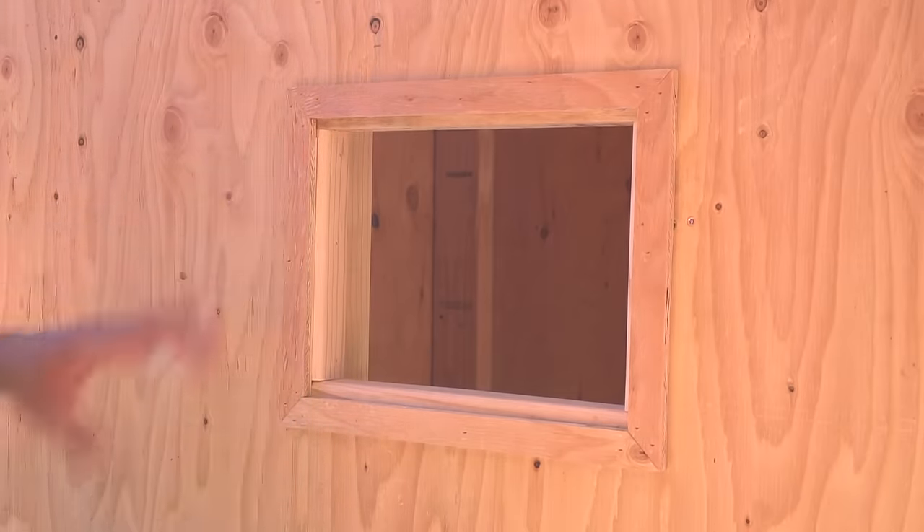We add some plywood to the base of our frame, and now it's time to make this nesting box more of a box. I'm taking scrap plywood and running it through the table saw, then making sure we have the appropriate angle so we also have an angled roofline, which makes it a lot easier for water runoff. As for dimensions, each side is 15 inches deep, the short side is 13 inches, and the tall side is 16 inches — just keep that in mind.